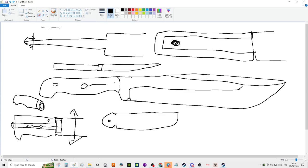Now, again, when it comes to full tangs, right? What you really want to avoid in your designs. And of course, this is not necessarily always the case. Sometimes, if it's not a heavy duty knife, this is not necessarily something you need to think about, right? Because we're talking about a super heavy duty kind of chopper, maximum strength kind of philosophy here. But when you're drilling those holes in your full tang, or you're designing the handle for your full tang, what you want to try and do is avoid putting a hole in the thinnest area of your handle.